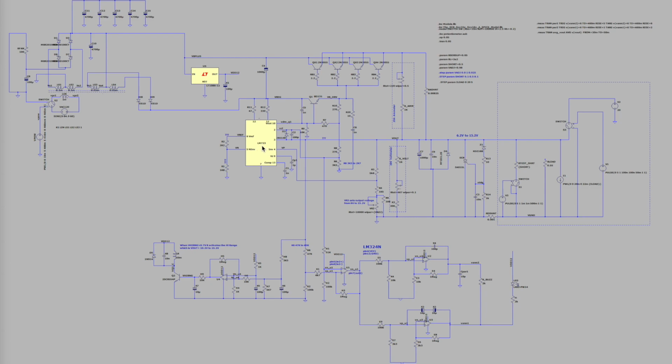the IC723, which is a linear regulator, the 4 2N3055s right up here, the potentiometer to control the voltage, it's over here, and the meter voltage, the meter itself and the controlling resistor for that, the trim resistor, and then the current source, current meter and the shunt. That's the SCR along with the Zener diode that controls the gate of that to turn on. And this is some loading stuff that I put in to short the output or do some other measurements, changing the load and so on.